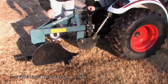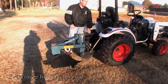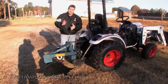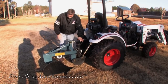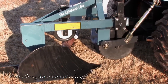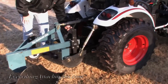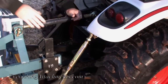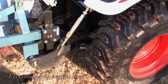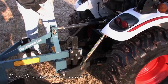We've also installed the optional gauge wheel. We probably won't need the gauge wheel because this tractor has a position lift with a full top-to-bottom adjustment, instead of just an up-or-down lift. If you have an up-or-down lift, you'll probably want the gauge wheel. This tractor has telescopic stabilizer bars. This right here will adjust completely on length, so that's not going to be a problem. This bar over here is solid - it has two holes in it and it's in its furthest down position.